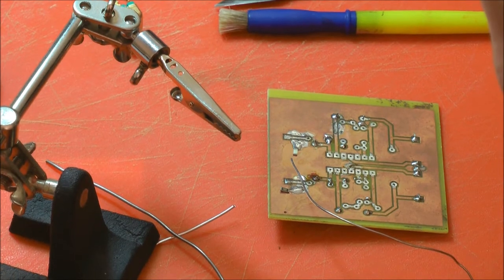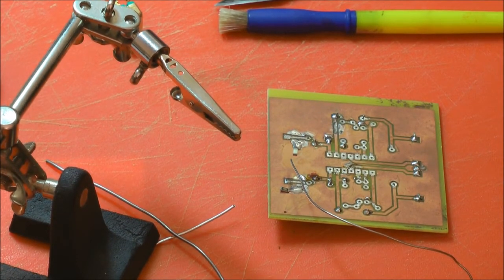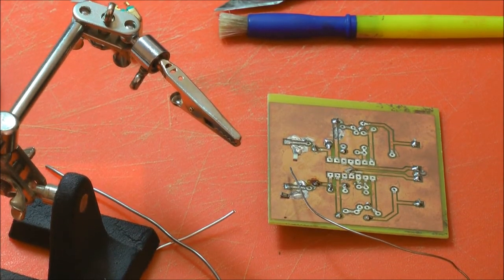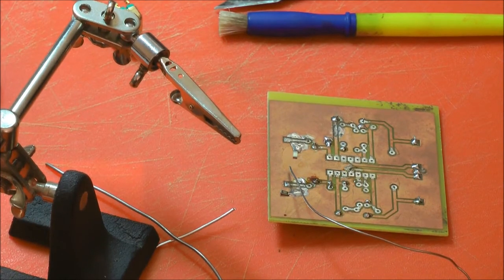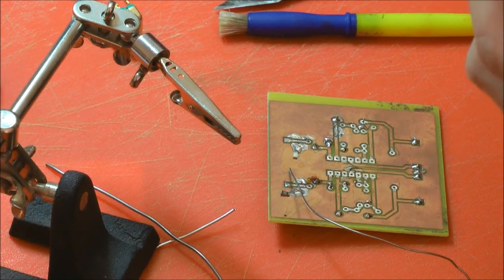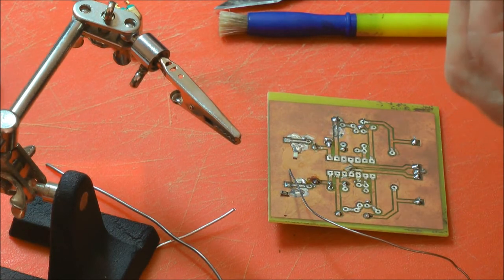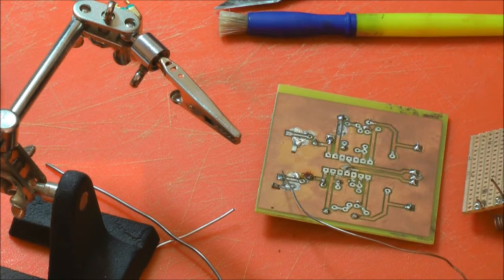And I had a nightmare of a problem on a particular piece of equipment where it had corrosion down the IC legs. It was a beast of an IC, ceramic chip, and it had to go in a temperature cycling chamber. So it was being heated, frozen, and the joints kept failing. And they looked perfect under a microscope, perfectly soldered, all flux cleaning put in there. And it wasn't until I took the IC out again and examined it that you could see pitting all down the legs of the actual component lead, and you weren't getting a thorough adhesion of the solder to the joint, which is a through plated joint. So there's the solder all the way through the board.